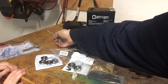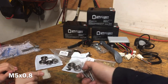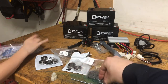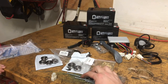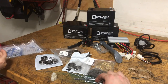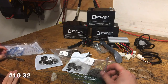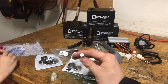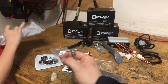Hardware — remember the case? We're missing those bolts. Originally the factory bolts are M5 x 0.8 millimeter thread, and four of them are about 55 millimeters long, and two of them are about 20 millimeters long. If you go to the local hardware store you're probably not going to find metrics in this length locally — you may have to order them. The next closest standard size you will find in various lengths is number 10-32 threads per inch, and that's actually what I got here, but when you get the lock nut it'll actually be bigger than the recess in the cover.